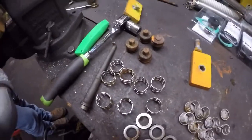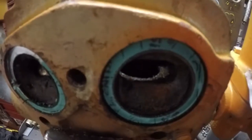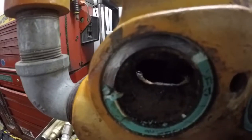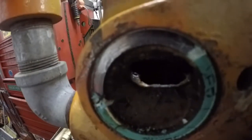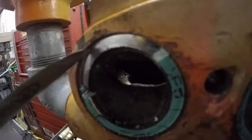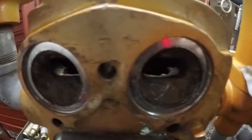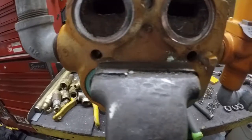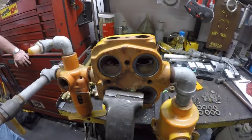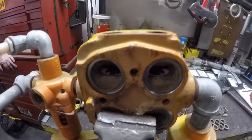We're going to proceed into rebuilding the pump. The next step is to scrape all four of the cylinder gaskets — you can see the cylinder gaskets have this green gasket on them, and we've started to scrape this one off. When you scrape it off, it has to be completely clean before you can put the new gasket back on. Make sure you get up around the edges of the head itself. We have the top two green gaskets off and cleaned off pretty well. We'll flip it over to the bottom and get the bottom two taken off as well. Now we have all four gaskets off and we're ready to start rebuilding the pump.